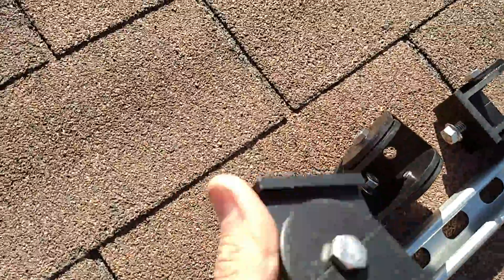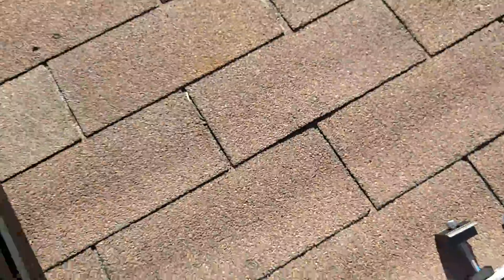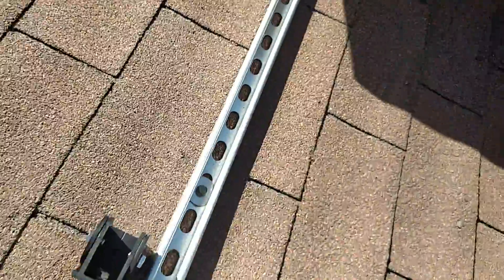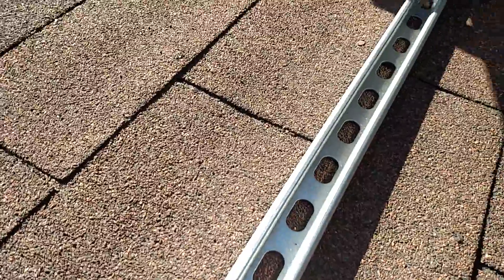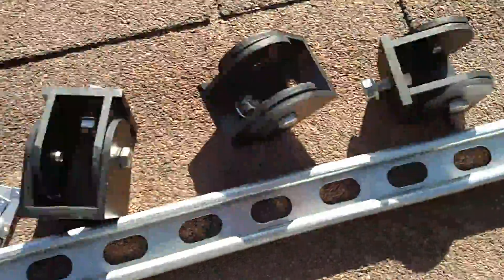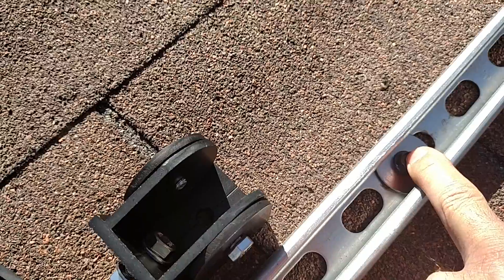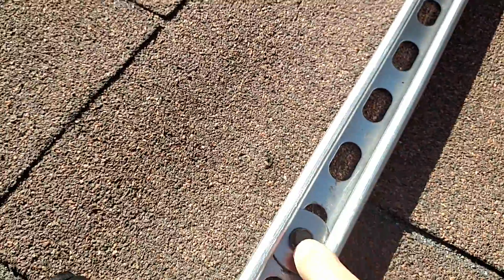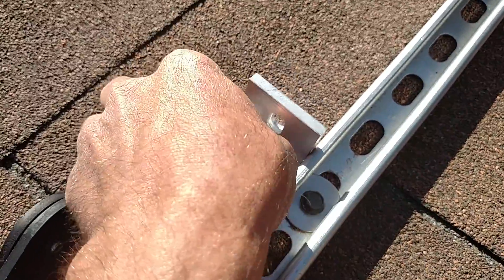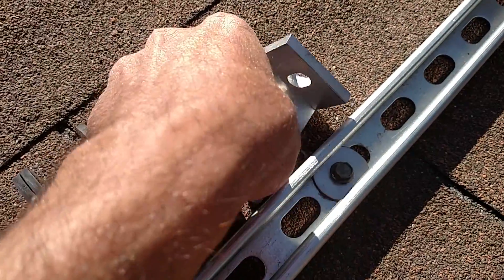Now, these are my angle brackets. These basically go on top of my L-feet. So I'm going to show you how this goes together. This is a unistrut that I've already got attached to the roof here — basically just ran it down and tied it into the rafters using these lag bolts. Basically drill a hole right on the center of your 2x4. Finding the first one is going to be the tricky part; after that it all goes 24 inches on center, depending on your building code or when your house was built.